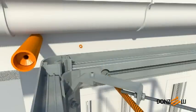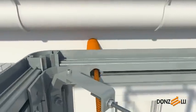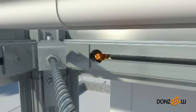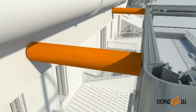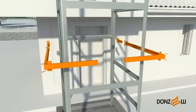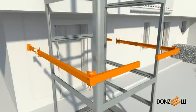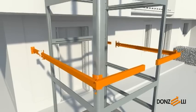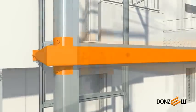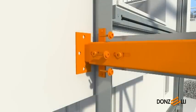In the installation shown here, the top of the shaft is secured to the eaves, which are about 10 cm away, by means of a special push-pull kit consisting of a threaded bar with chemical expansion plug and counter tube. The shaft is secured using the method already described. If required for the specific installation, a variety of structural reinforcement options are available, including struts, crossbars and bracing beams. On the installation shown here, a special telescopic tie is used to secure the free rear uprights. After making the necessary holes in the uprights, assemble the two parts, position the tie at the specified height, and secure it to the structure using the set of metal fasteners provided. Once the telescopic ends have been adjusted, fixing to the building is completed using expansion or chemical anchor plugs, as is suitable. A mounting plate system is also available upon request.